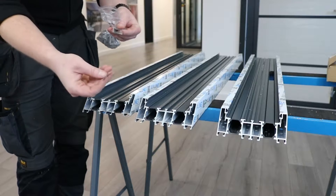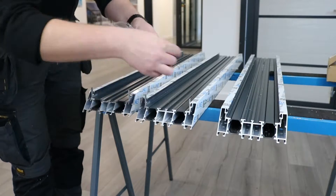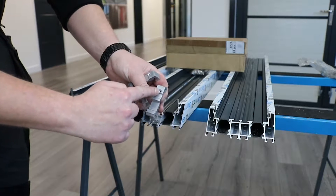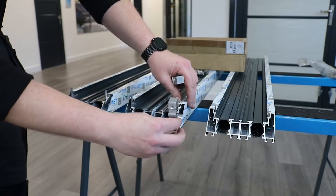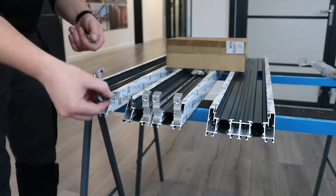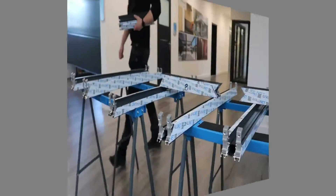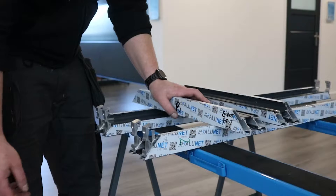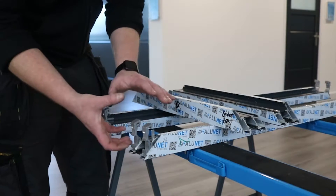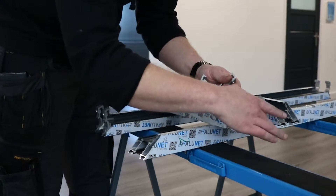When putting the sashes together, one chevron goes in the bottom slot on each bar. With the sash cleats, the holes are offset to the outside of each sash — that's the same for each sash. Silicone around each mitered edge of the sash profiles before assembling. To put the sashes together, it's easier to have the cleats in the widths so they can just be slipped in, and make sure that your chevrons sit in the slots properly.